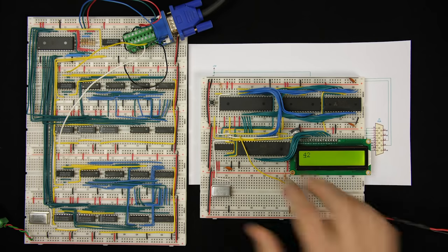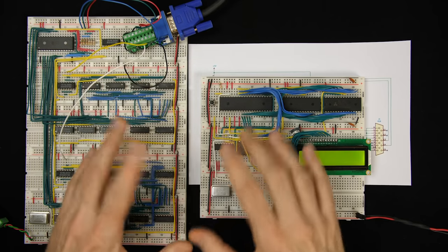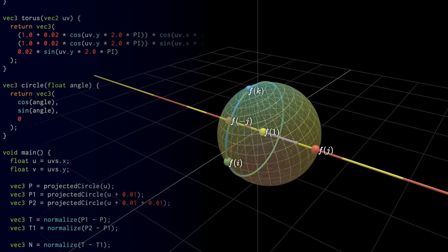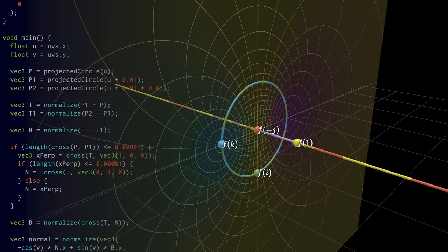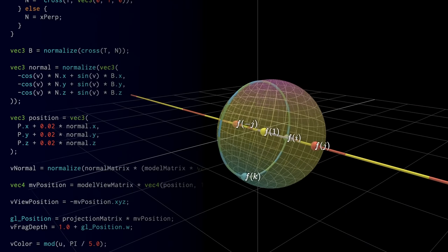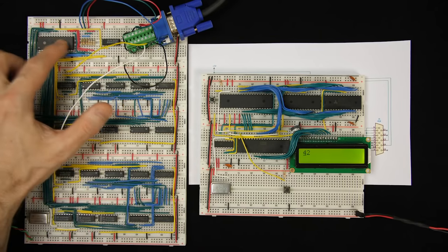In a modern video card, a lot of the RAM is used for other processing. For high-end 3D graphics, rather than having the CPU itself come up with every pixel and fill the frame buffer, the computer sends mathematical descriptions of 3D objects, surfaces, lighting, and camera positions to the graphics card. Then the GPU computes the actual pixel values and fills the frame buffer — offloading a lot of work from the CPU. But we're not going to do anything fancy like that; we just need some RAM to replace this EEPROM and hold the frame buffer.